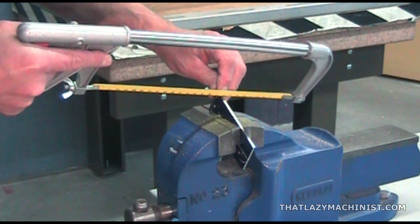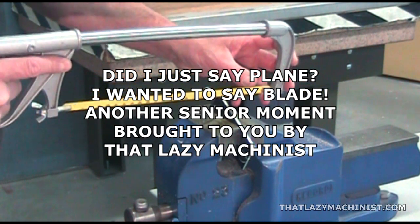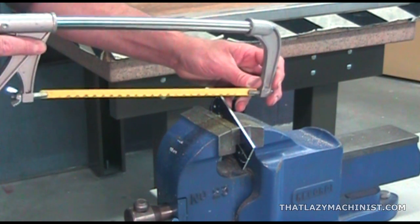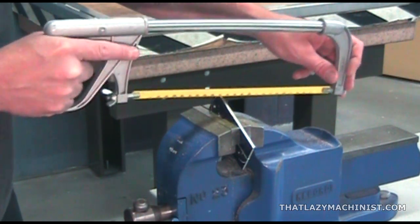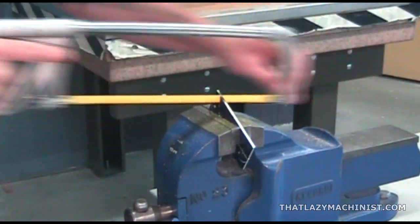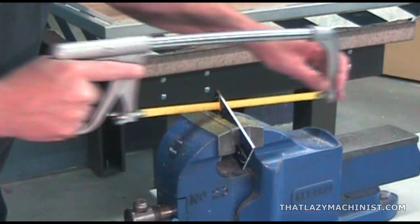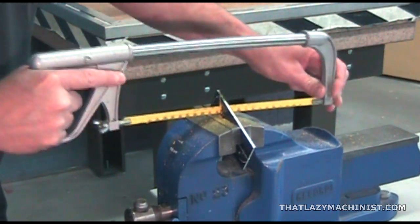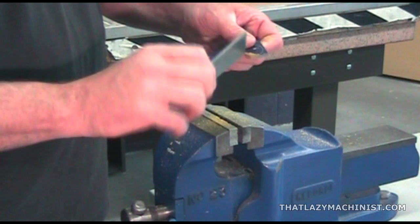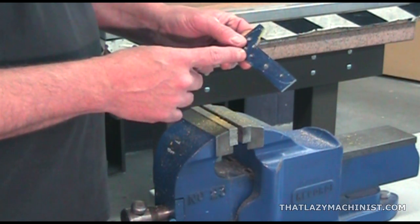Now it's very difficult to engage the blade in the work part angularly. So before we do that, we're going to have to notch the part. Then we can engage the tool into that notch to start our angular line. Now don't saw all the way to the finished surface that your cut is working its way towards. Leave a little tab. You can break off the excess material and that way avoid notching that finished surface.